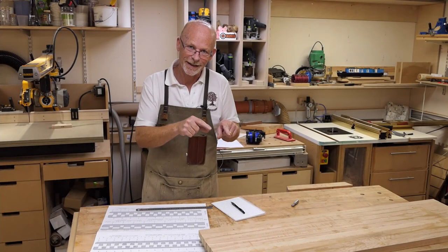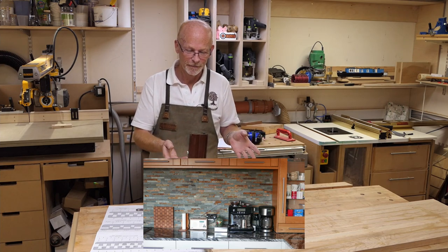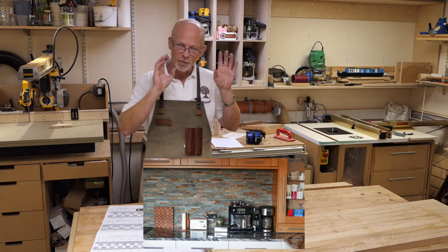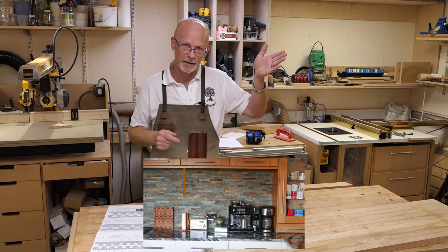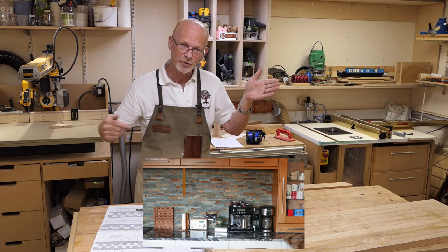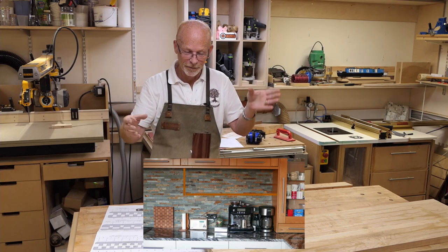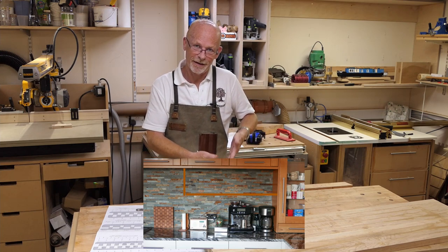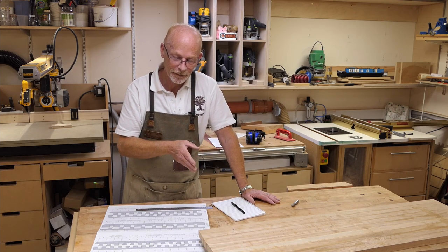This is the area in the kitchen where my nearest and dearest would like the shelf, but I'm not happy to drill through the slate-effect tile on the back wall. So what I intend to do is have a vertical going up from the shelf on the left-hand side, drill down through the bridging units at the top, and also drill in through the glass door cabinet on the right-hand side to support the shelf. That join between the vertical and the horizontal is where I intend to put the half blind dovetails.